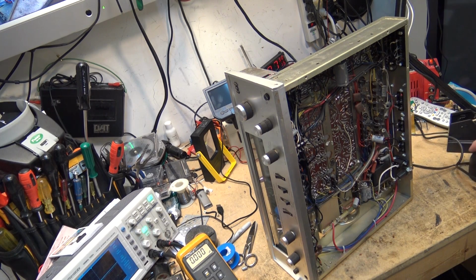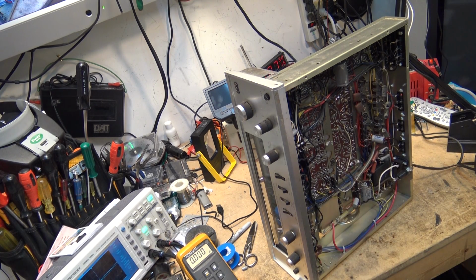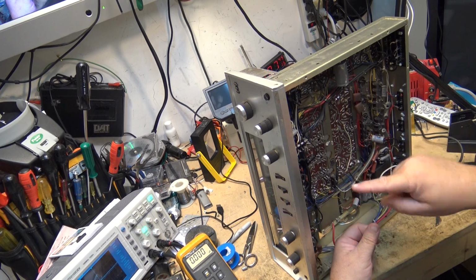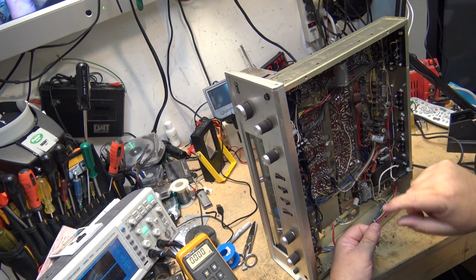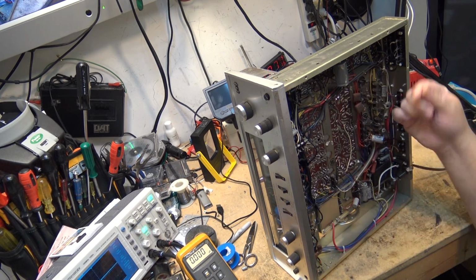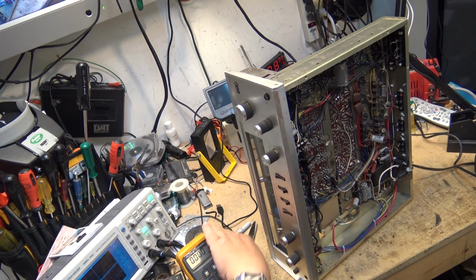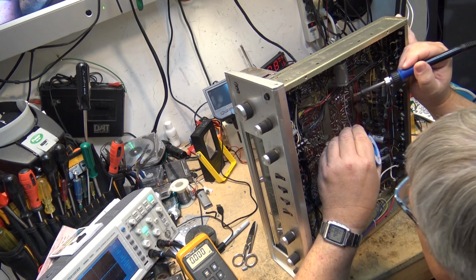If you don't want to use solder wick or a solder sucker to take off the solder on these plated boards because they've gone over all the traces with solder, sometimes it's just as easy when you heat it up and you stick the component through. Just roll it in your fingers to keep the wire turning as you remove heat, and it won't make a connection. Then when you heat the other land on the other side, you can push the part through, and because the first side didn't fuse to the board, you can push the component all the way down.